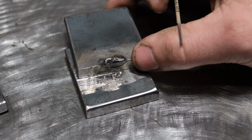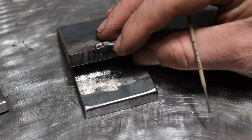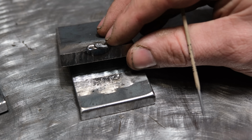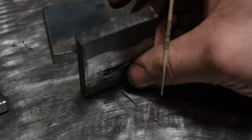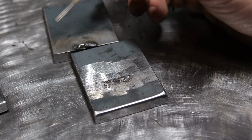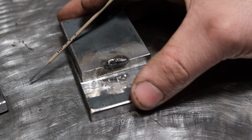Now the stick weld, you can see how absolutely atrocious that is. Basically the only part that actually glued anything that broke is this right here. So you're talking maybe an 1/8 inch, 3/16, somewhere around 3 millimeters. And that's pretty sad right there. That's basically the only part that stuck. All of this wasn't even adhered. It was just sitting there. And we saw barely even a whisper.